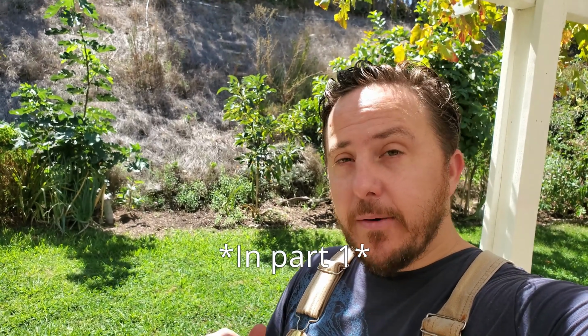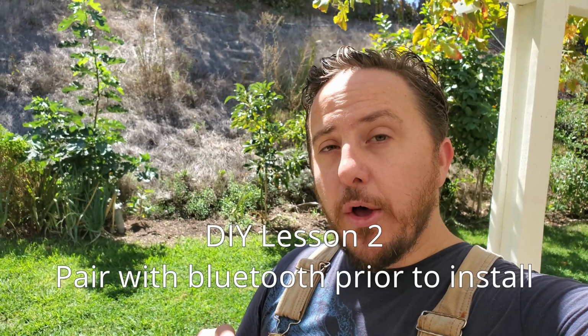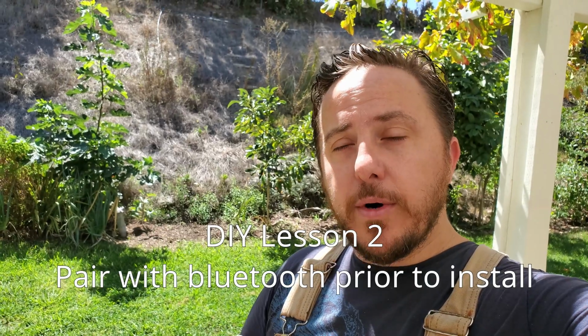Installation was actually pretty easy. I think I had 2 DIY lessons learned, and the first one took place during the time lapse. The second one I didn't record because it came with the smart app. If you're going to install one of these, the exact same model, make sure that you download the app and pair your phone to the machine prior to installing it in the attic. Fortunately, I'd left the stairs and ladder down, and then went to connect to it, and you had to press the pair button for 3 seconds, which was not in the instructions. So just remember that is my DIY lesson learned.